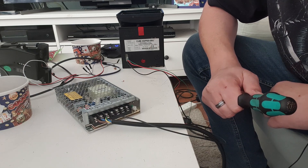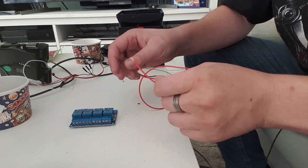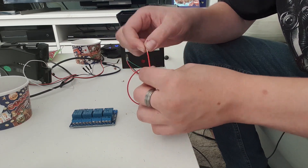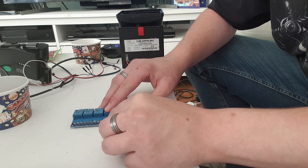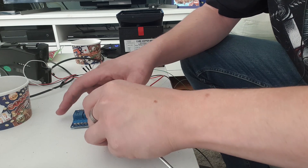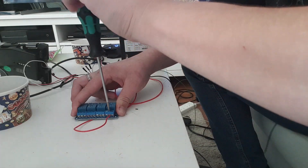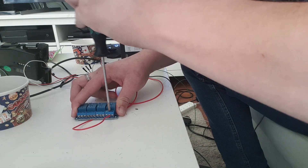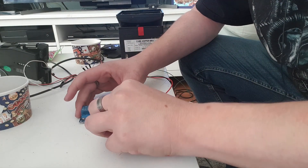Remember, when dealing with electrics like this, you want to be as safe as possible. With the red wire coming directly from the hopper, we want to hook it into our relay. We're going to put this in relay one, labeled K1, and place it inside the middle terminal. Unscrew the screws to allow a flush fit and install the wire from the hopper into the middle, then ensure the screw is tight so it doesn't come out.